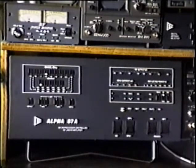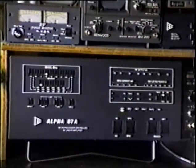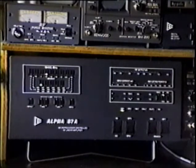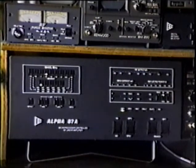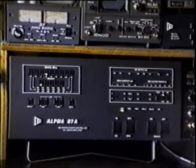There's no reason to design that to handle such extreme abuse. I don't want to give the impression that the amplifier is designed to handle 500 watts of drive, or even really 200 or 300 watts of drive. It is designed to protect itself against accidental, occasional application of excessive power at the levels that larger modern transceivers are capable of delivering — up to 200 watts carrier — and, under some conditions of misadjustment when the drive control and ALC controls are not set to manufacturer's specifications, possibly occasional spikes up to about 400 watts. The 87A will protect itself against that sort of thing, but it is not intended to protect against foolishness such as driving with a 30L-1 or some other 500-watt source.